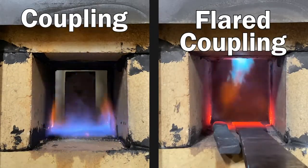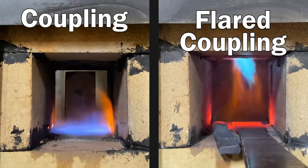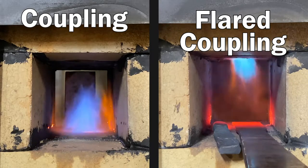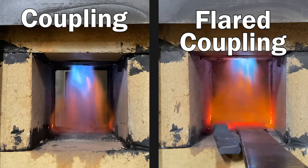One of the main things I learned is that the Frosty T burner functions much better once the forge has had a chance to come up in temperature. To accomplish this, I choked the air input initially, testing every few minutes until the forge had increased enough that I could run the entire range of my regulator without losing the flame.